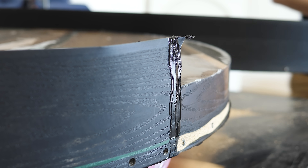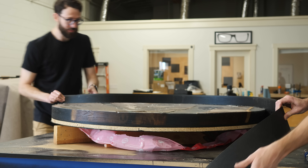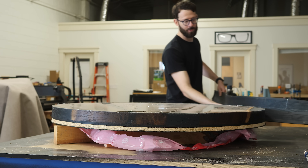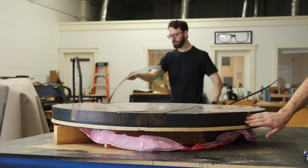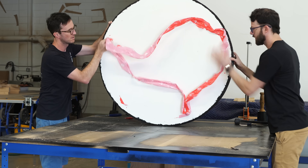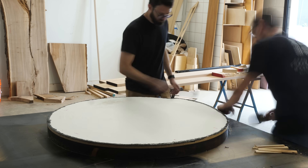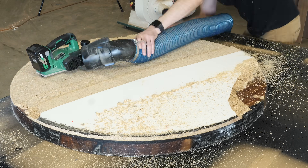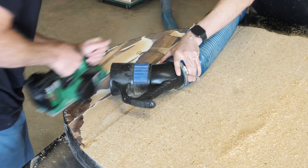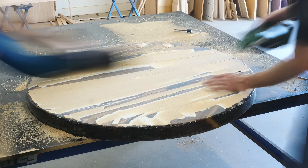The most satisfying part of this entire build was removing the landscape edging — it peeled off perfectly. That's a legitimate smile on my face right there, and this is a genuine reaction from Sean: 'Oh, that's reusable!' Unfortunately, that was followed by realizing that the melamine base was completely stuck to the slab, and there was no way to cleanly peel it off. Which meant we had to spend a few hours using a power planer to essentially pulverize the entire sheet of melamine. So my takeaway is next time we're going to quadruple the amount of mold release spray we use, and maybe even line the bottom with more tuck tape.